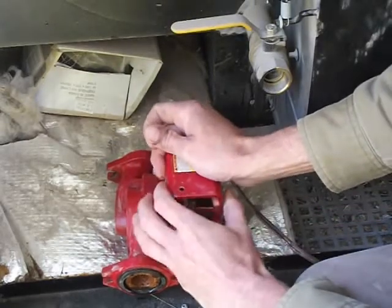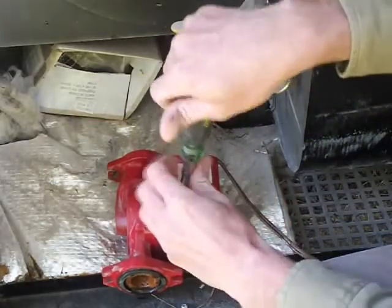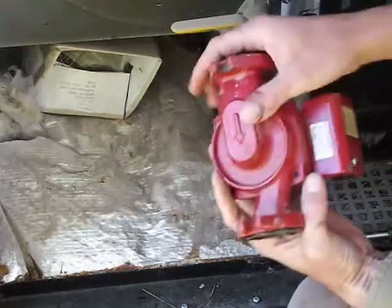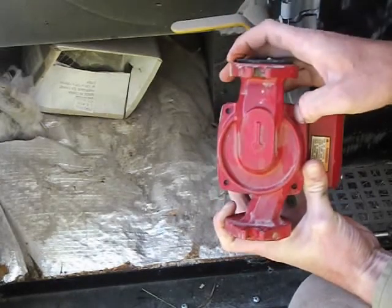So I'll put my cover back on. Don't pinch your wires — I've done that and shorted it out and flipped the breaker. Make sure your direction is correct when you bolt back up. You want your arrow pointing the same direction as before, or you'll reverse flow in the system.